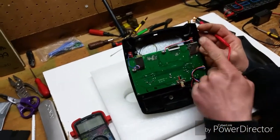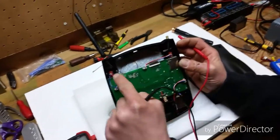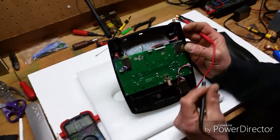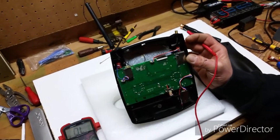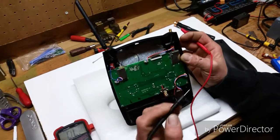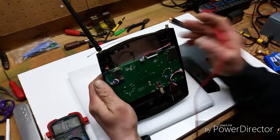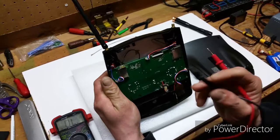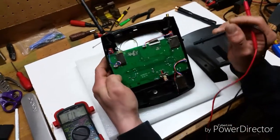If you needed to splice your wire, that's actually a better connection than an IPEX to UFL — that's what those wires are. If you're not sure which one is the ground or which one is the positive, use a multimeter and set it on continuity test so it beeps. It doesn't matter if you use the red or the black when you're doing a continuity test — all that means is when you have metal-to-metal contact, they are going to beep. That's how you can find the ground.